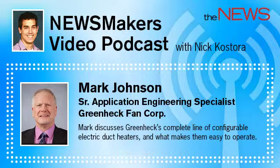And so what types of applications are good candidates for duct heaters? Our entire collection of duct heaters carries a UL 1996 listing, which makes them perfectly tailored for any commercial electric heating need. They are commonly applied to serve as primary heat supply, but certainly can be used for reheating dehumidified air, space heating, and, of course, backup heating.